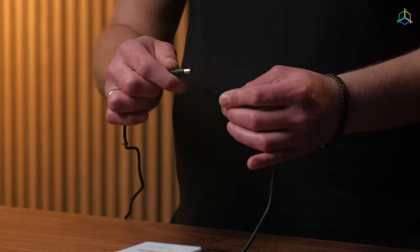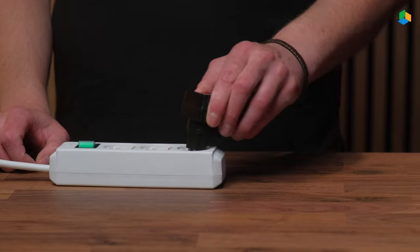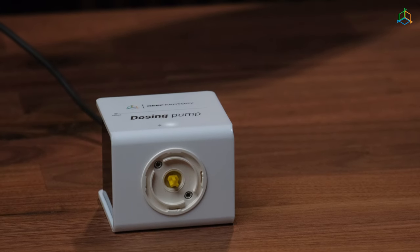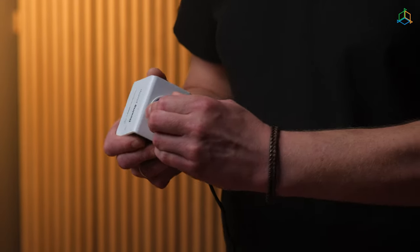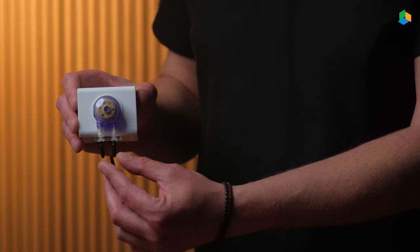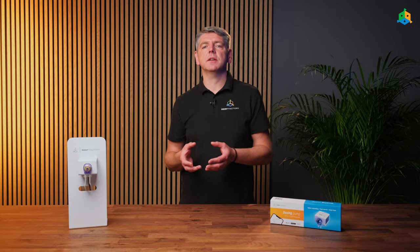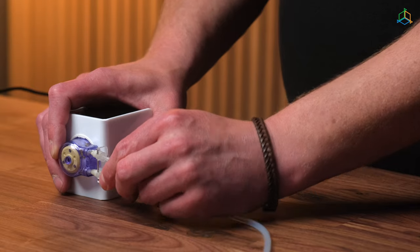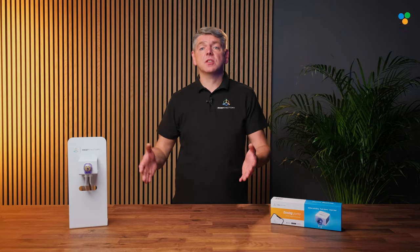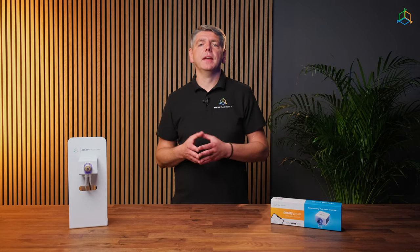Connect the power supply to the device. Insert the power cord into the tightly fitting socket and make sure the cord is not loose. Then connect the power supply to the mains. The unit will start and the dosing pump power indicator light will illuminate at the top. Fit the dosing pump and insert a twist and lock pump head. Remove the black plugs from the ends of the hose and insert the hose. The length of the hose should not exceed 2 meters, as this may affect precision of dosing. Insert the ends into the container with a fluid and a sump. The liquid is taken from the right hose and poured from the left hose. Once this is done, we can mount the pump in a convenient place, connect it to the power supply and proceed to the next step.